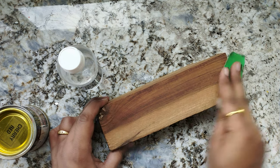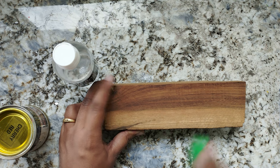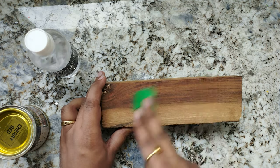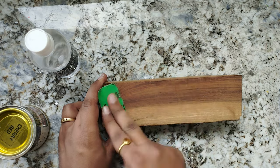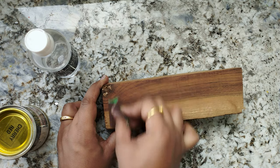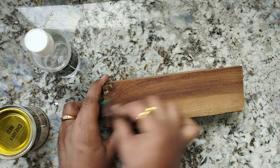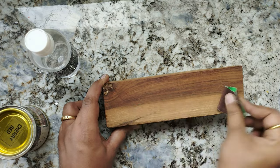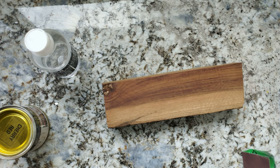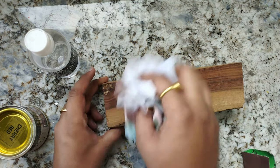An exceptionally dense tropical hardwood, teak wood's high oil content and low shrinkage ratio make it a favorite for exterior furniture, bathhouse floors, and marine construction. Teak's compact grain holds fasteners securely so that items made from teak are stable and can last for decades. When exposed to sunlight, however, teak wood ages to a silvery shade but retains its smooth grain. Refinishing teak requires sanding to remove the aged surface of the wood before applying a protective teak oil finish that enhances the wood's natural luster.